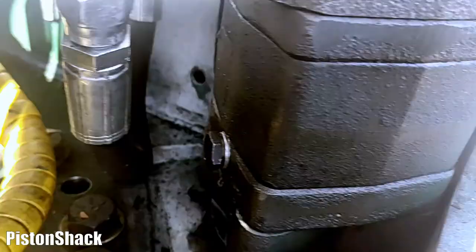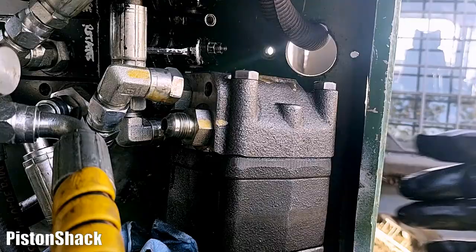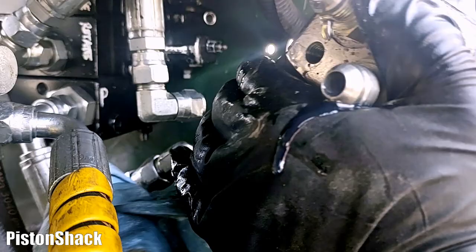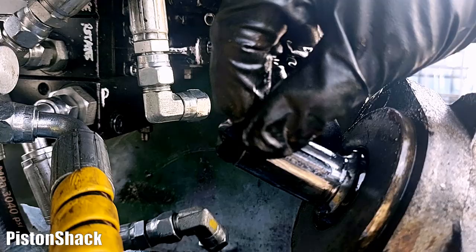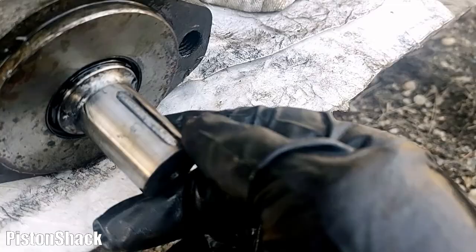One motor is on one side and another side has different bolts — that one is not our problem. The motor on the left side failed. Let's get to that motor and pull it out. As you can see, everything is disconnected and that motor is coming out. Every hydraulic motor has two same-diameter hoses coming to the unit. As you can see, there is a key slot — and that key is sheared. Only half of the key is left.